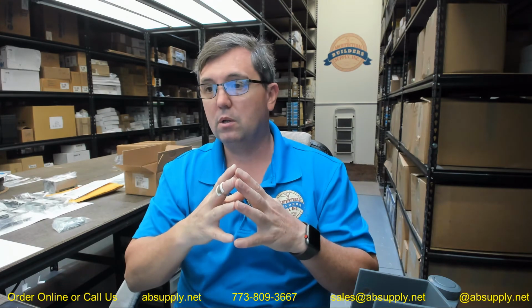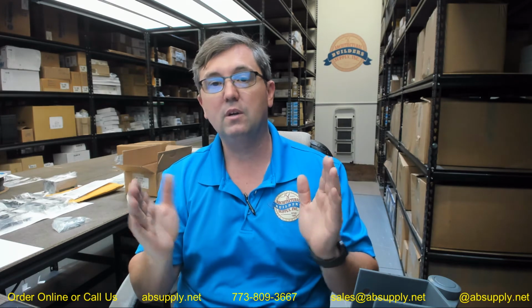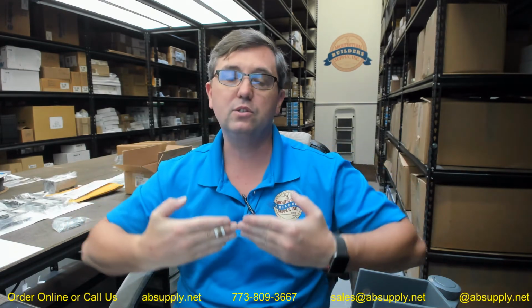Okay, next call. I got a pair of doors and one door is sitting kicked out a bit. Okay, and I've got the tension collar down. Okay, turns out one jam has got a toe to it. So unless your frames are literally square, plumb, true, expect a little bit of movement required via shims underneath the hinge leaves to make the door sit the way that you need it to. Whatever marginal defect there is in the frame is going to be amplified when you're getting inches and inches away, and the door is going to sit askew. So be mindful of that.